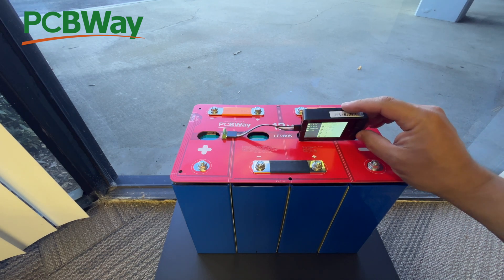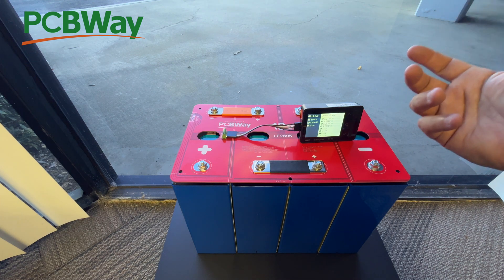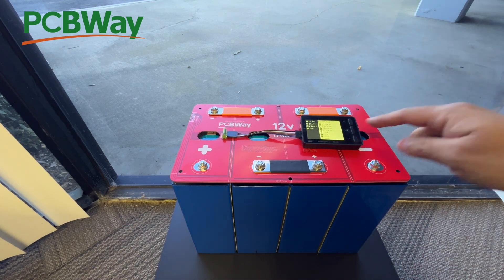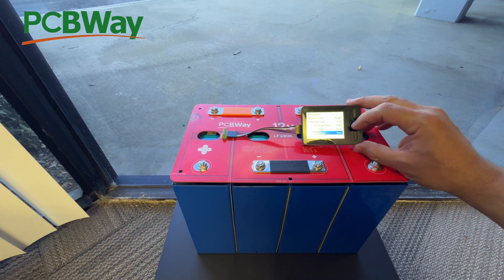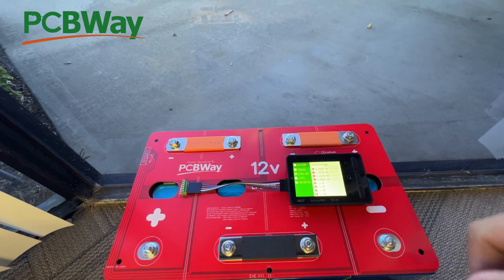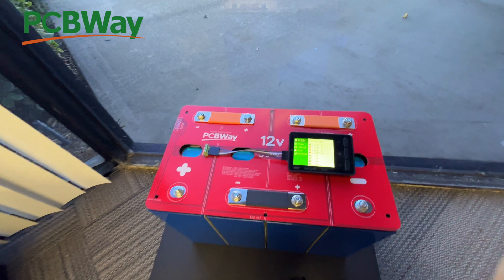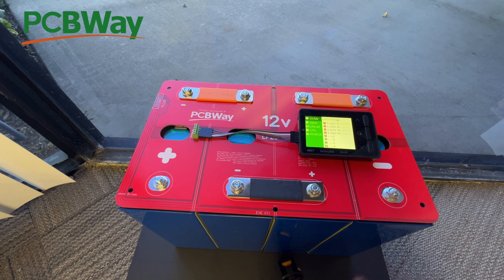This little unit is very small, very simple, and inexpensive. A lot of people are using batteries like this — they just put their load on it and check it every once in a while. If the cells are drifting apart, there's a balance function you can activate. As you can see, you click on that and once it's green it's balancing. This one has a 20-millivolt difference between the four cells. That's why you don't really need a full BMS — cell quality has gotten much better. Back when I started using lithium iron phosphate 10 to 12 years ago the differences were much larger.